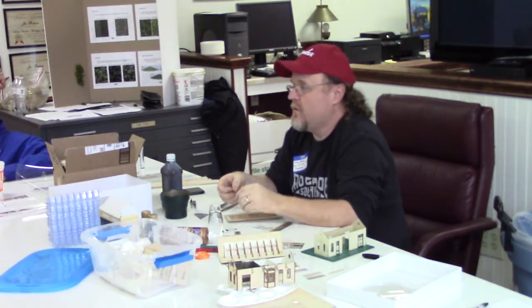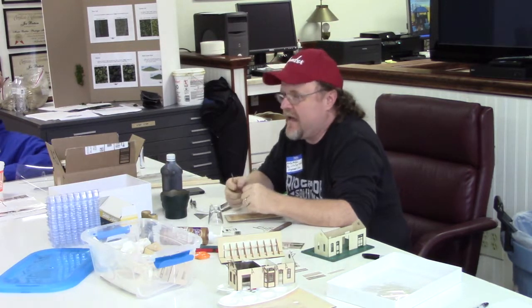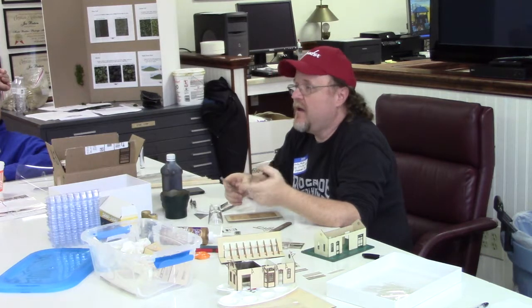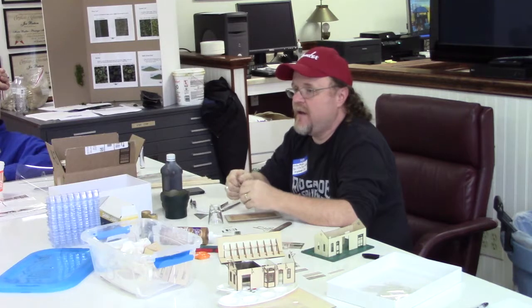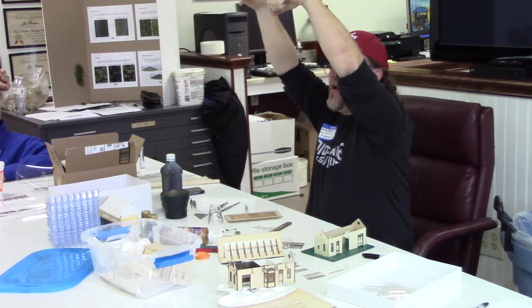It's too uniform. If you have fresh, really nice paint, that head will not be exposed. You shouldn't see it anyway. I had a guy who used to love to argue this with me all the time, so I did a test. I stuck a 16 penny nail, which you would never use anything that big to put siding up, in a 2x4 and painted over it, stuck another one in the other end unpainted, stepped off 87 feet. And I asked him, where's the nail on the unpainted side? And he goes, there. I said, exactly.